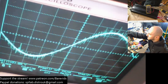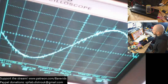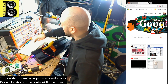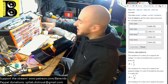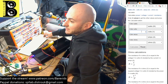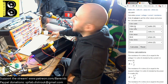Let's go to clipping. You can see clipping comes in at about here, so we're going to back off just a tad — to about there. And that there is less than 1% THD, so that is our first test. Now let's work out how much power that thing did. We're going to bring it up on here because it's easier to see. Very easy calculation — we have our volts which was 39.8, and that is at 1 ohm so we'll see 39.8 amps. That gives us our power: this amplifier did 1584 watts at 12 volts at 1 ohm.